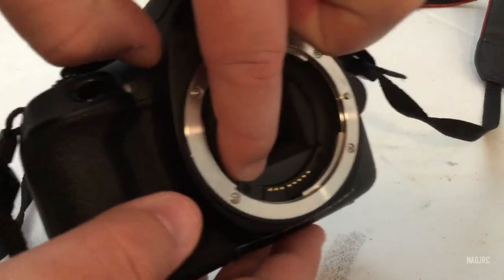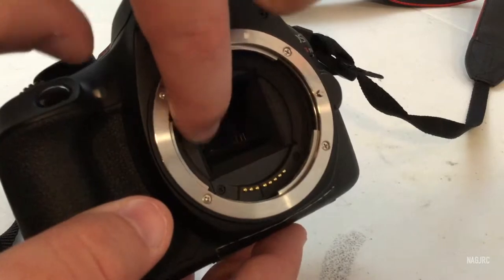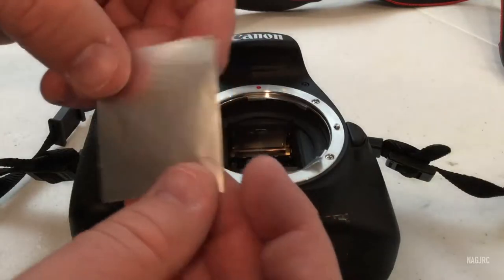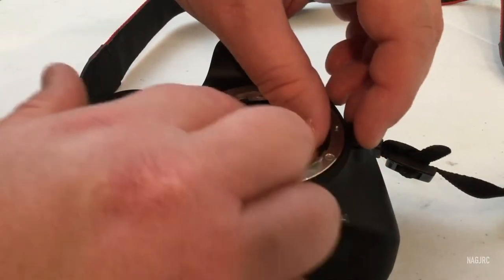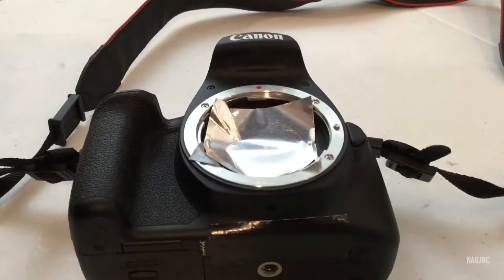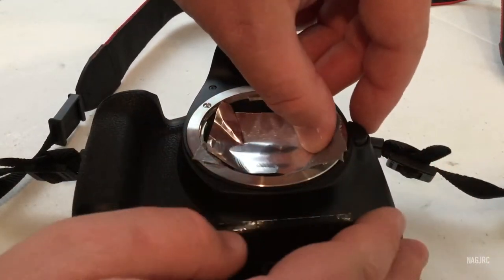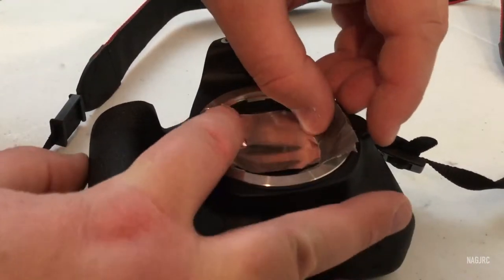In this camera, there is a flat surface flush with the shutter's open position and at the exact distance from the CCD to focus the light from the pinhole. Cut out the foil in a shape that is just slightly larger than the area of the shutter recess. Notice that there is a shinier side of the foil, and you want that pointing out. The less reflective side will be on the inside. Covering it in black sharpie might enhance the effect, but you run the risk of ink flaking off into the camera, so I decided to just leave the bare metal.